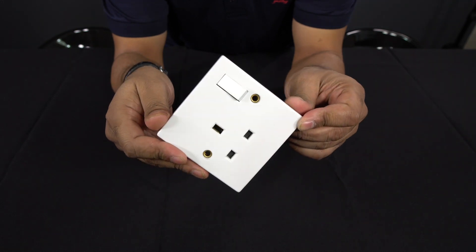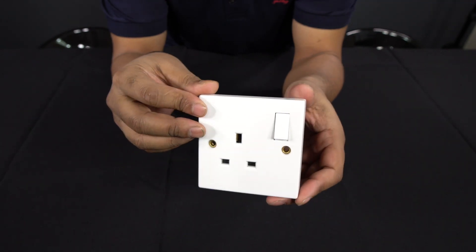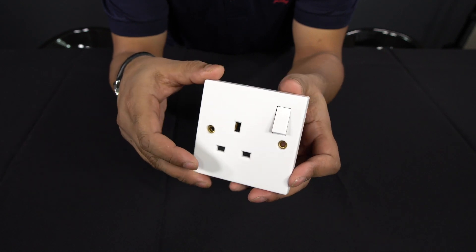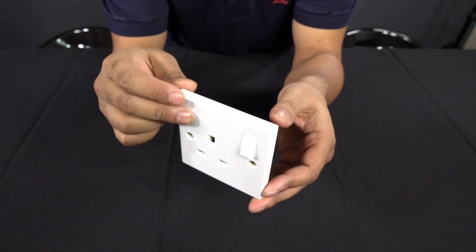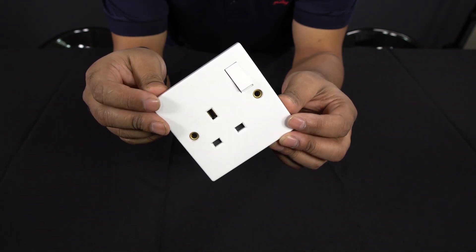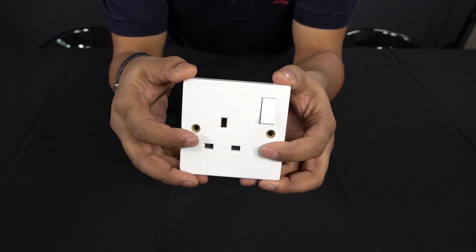The reason I'd like to share this with you is because recently we bought a cooker for our mother — a Cannon cooker — and we had it installed, but we just couldn't get the ignition to fire. On gas cookers there's an ignition that goes click click click and then the gas fires up, but the ignition would not fire no matter what we did. So we called Cannon and they sent one of their engineers around. He had a look at the cooker and said it looked fine, then checked the plug wiring and said, 'Let me test your sockets.' He took out this contraption, shoved it into the socket, and it had some lights flickering on it. Straight away he looked at us and said the problem is that your sockets are wired the wrong way around.